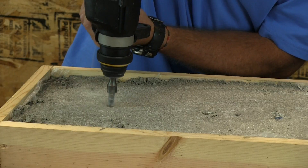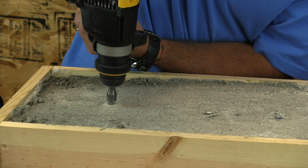If you've ever installed drop-in anchors in concrete, you know it can be just a little bit frustrating to not really know if you've got the anchor in all the way or if it's set really well. The Powersmart DI Plus system takes care of that in a pretty simple way. It comes with a series of bits of different sizes, a series of setting tools of different sizes, and anchors of different sizes. Basically what you do is put this in a rotary hammer and drill your hole to a predetermined depth.